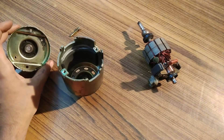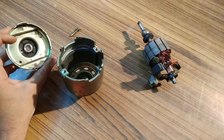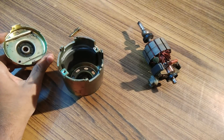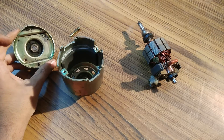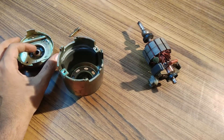The good thing is that these motors are on bushes and not on bearings. The bushes don't die that easily, but bearings get a bit problematic with age. The bushes have an advantage, but they also have a slight disadvantage of an increased level of friction when compared to bearings.